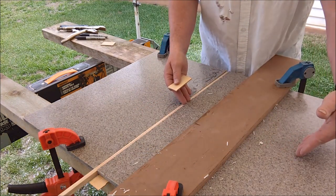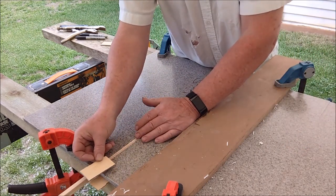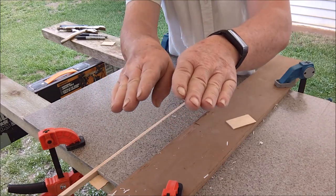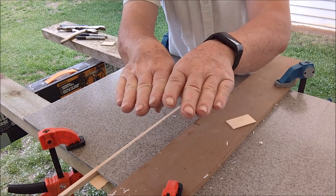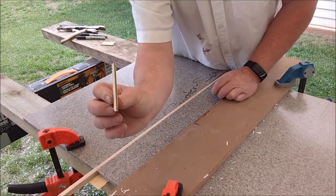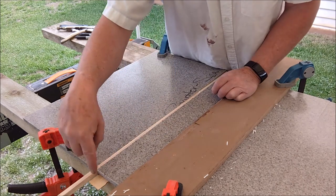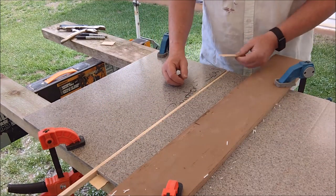These pieces are roughly speaking one foot wide. By lifting that up that little bit, it gives us about a few degrees — maybe one degree — of difference between the pieces. The reason for that is that when the two pieces are cut with a mirrored cut, they'll then kind of fold together and that top edge will mirror exactly together. So that's one of the main tricks: door skin, about one-sixteenth or one-thirty-second of an inch. Just a tiny strip on your leading edge.